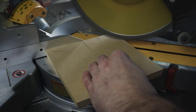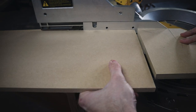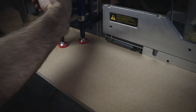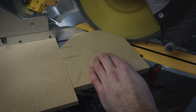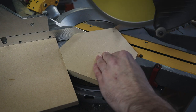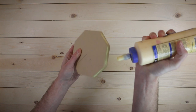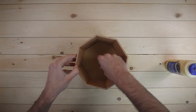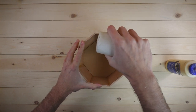Back to business. The trick here is to once again carefully measure and lay out that first cut, then set yourself a stop block and lock in that dimension. From there, with your saw set at 45 degrees, it's just cut, rotate, cut, rotate, till you've got yourself a perfect octagon. Once all your support pieces are cut, apply glue to the edges and tamp them down inside the hammer's head. These should be nice and tight because we're relying on a snug pressure fit as our only form of clamping pressure.